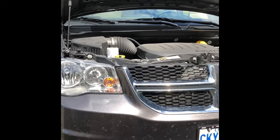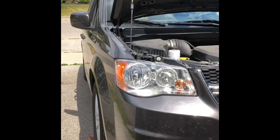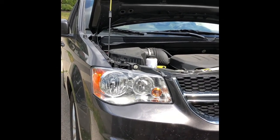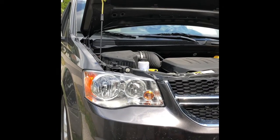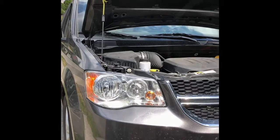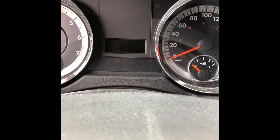Go up top and add the oil. Fill up a good portion of the oil, then put the van on a level surface, turn the engine off, and let it sit for about five to ten minutes. Then check the dipstick to see where you're at, and if needed, add a bit more oil.